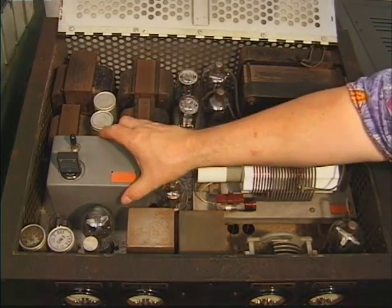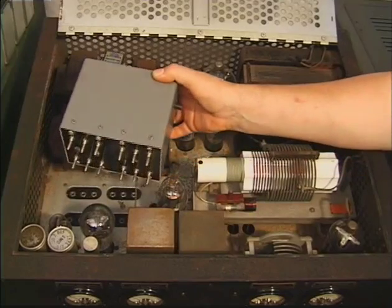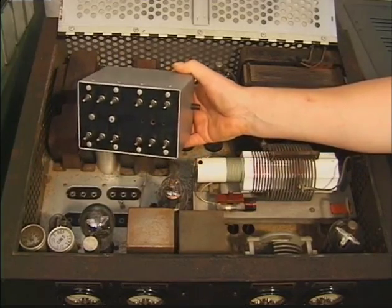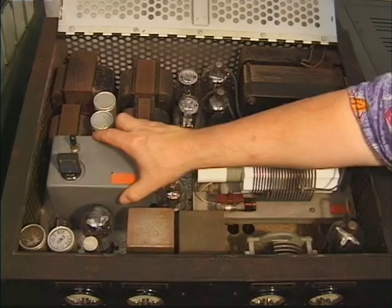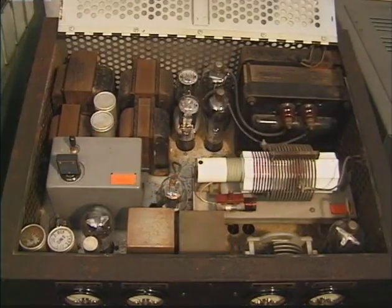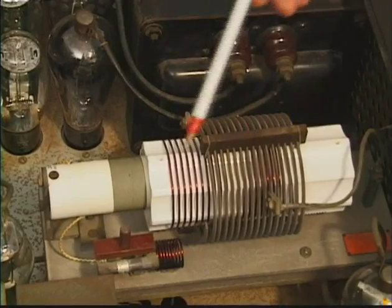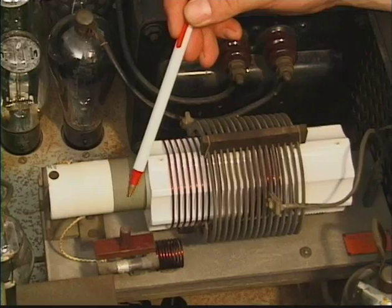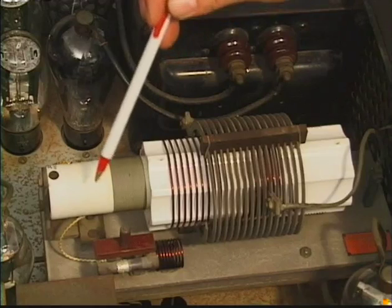The first was an interchangeable frequency shift unit, an aluminum module that housed the crystal, the oscillator tank coil, and an optional multiplier coil. Banana pins mounted on its bakelite base on the bottom provided the electrical connections to the main chassis. The second frequency change module was the final tank assembly, which contained the driver coil cleverly positioned partially inside the final tank coil to do double duty as an inductive neutralization element as a legal workaround to capacitive neutralization. A rack and pinion provided adjustment means for obtaining the correct amount of inductive coupling.